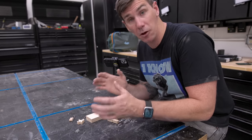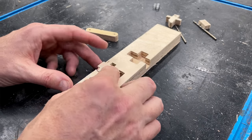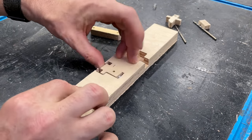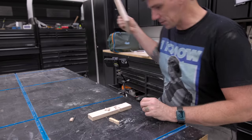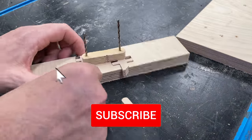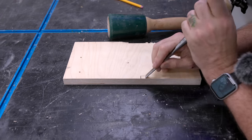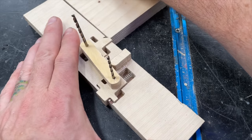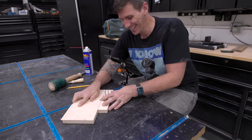I've got all those pieces cut out on the CNC — this is just a mock-up. Each one of these little pieces slots down in here; that is going to be the button. It'll actuate this way and I'm going to drop a little spring back here behind the button so it should have some springiness to it. This is what captures the knife tray that's going to slide in, knock that piece out of the way, capture it, come into that little indent, and catch. It actually worked.